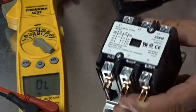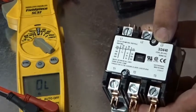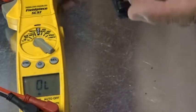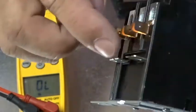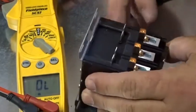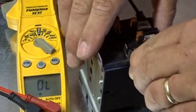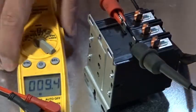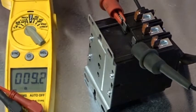This is a three pole contactor, typically used in commercial work. You can see it says 3, 24, 40 — that's three poles, 24 volt coil, and 40 is the amp rating. The coil connections are A1 and A2, and there are two spots on each side so you can jump it off to something else if needed. This one is right below 10 — so if you were saying this one's bad, well, it's not, because the ohm rating for a three pole contactor coil is a little bit different. That's 9.2 ohms on that one.